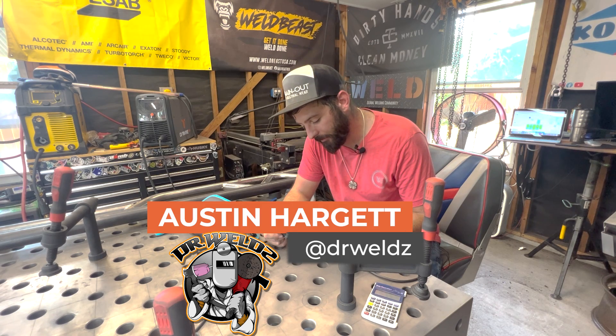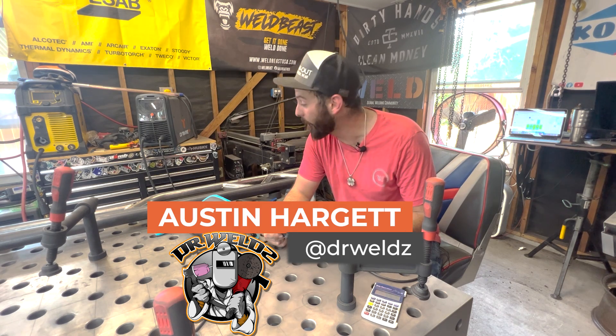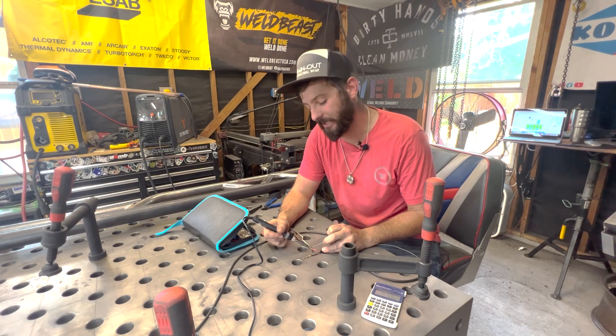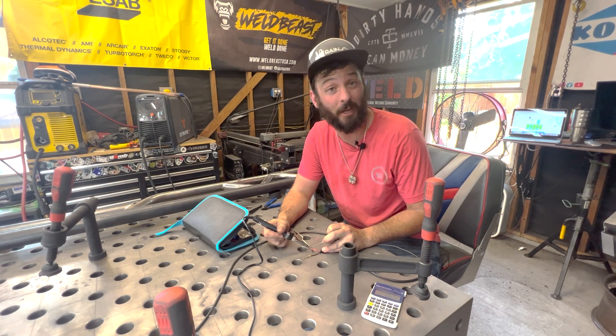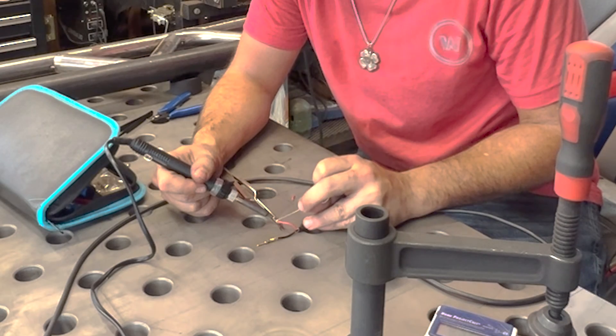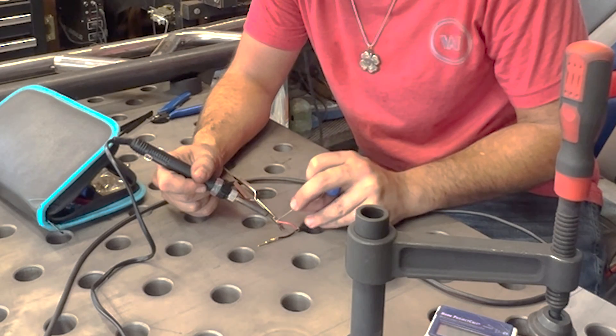Welcome back everyone. You might be thinking, what are you doing? You said we were going to be welding today, not soldering. Well, we still have to do some CNC cutting - we've got to cut the mounts and everything for the truck as well as some of the steps. So we're going to be using the CNC table to cut some of that stuff. I'll be providing the DXF files for that. But I am soldering right now because I went and yanked on things and didn't have the proper connector on the back, so now I don't have any torch fire.